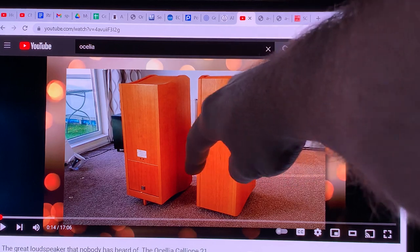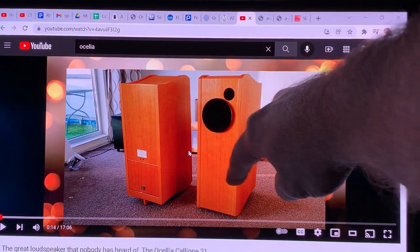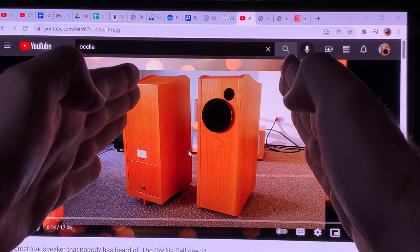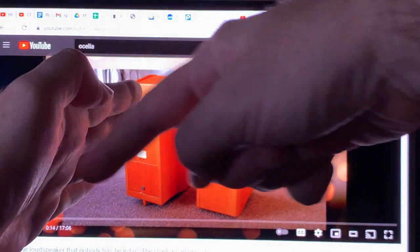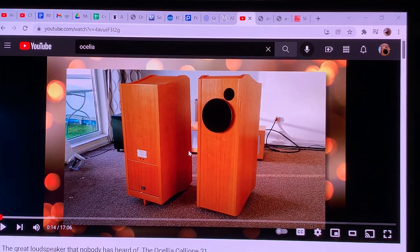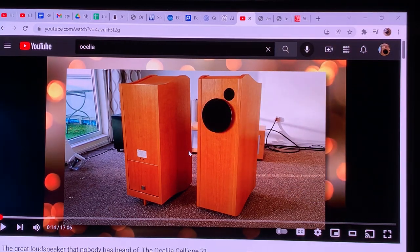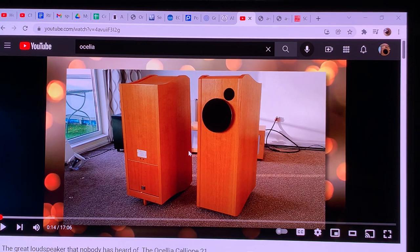There would be a dominant resonant frequency determined by the width of the loudspeaker. But if the width is different at the front than at the back — meaning the whole thing is tapering — then there's no single frequency bouncing left and right inside the cabinet. Toward the front you have longer wavelengths and shorter ones toward the back, so there is no single dominant frequency in the spectrum. The same applies to the front and back panels.